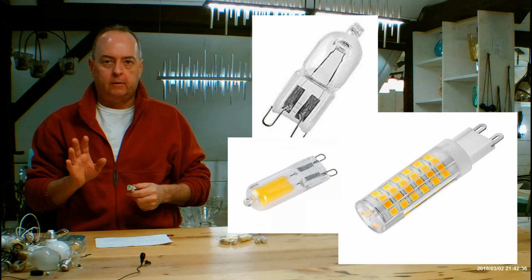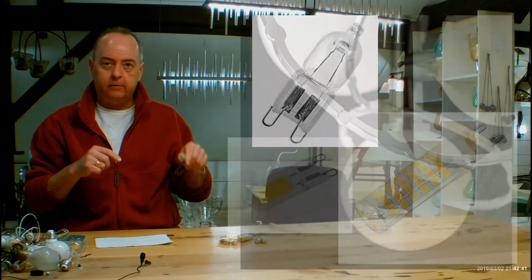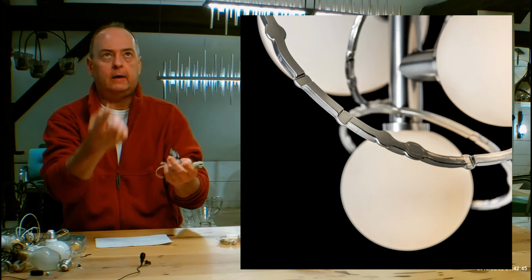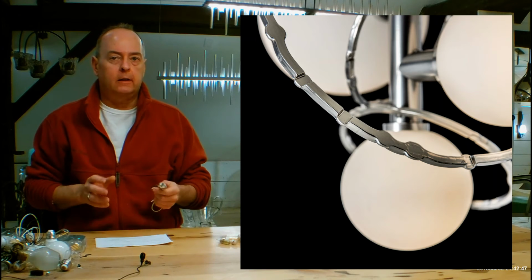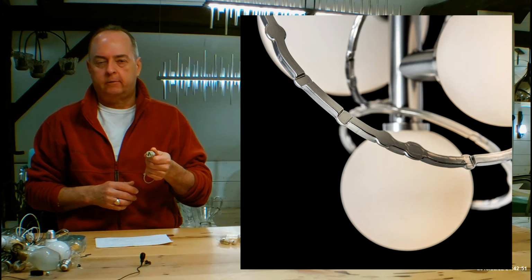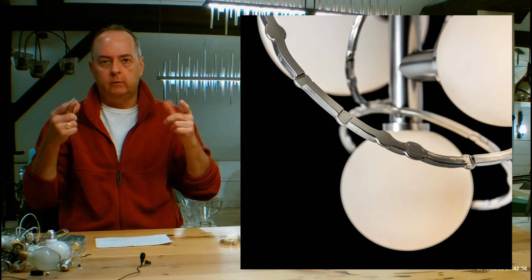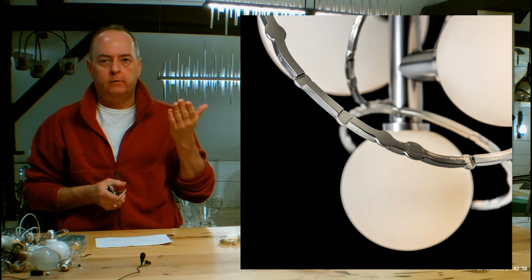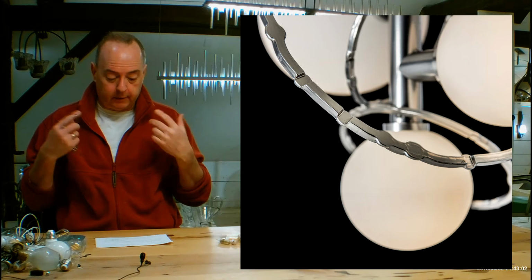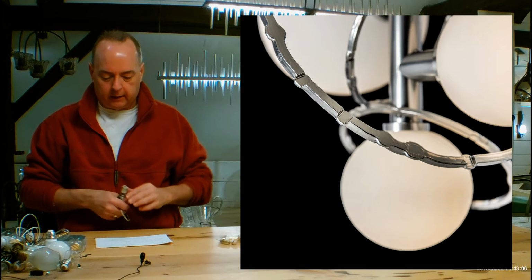The other thing I talk about all the time is you can choose the color temperature for the light that's coming out of these things. This is 3000 Kelvin, so 3000 K, and that's coming out of the LEDs that are above me, which I like, especially if you're going to be using this in a bathroom. Same deal with those sconces I talked about earlier. You want to have a light that's going to make you look good when you look in the mirror. If you go for the higher numbers, 4000, 5000, 6000, that's super blue light, and that's going to kind of make you look a little funny. So you really want to have this nice warm light on you.